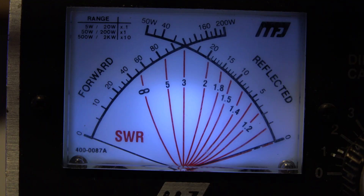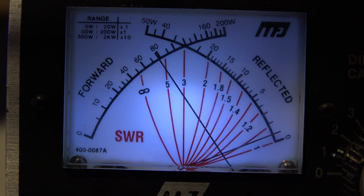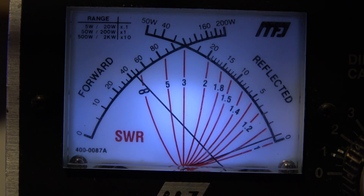Switching over to the much more precise external meter — this shows about 75 watts, maybe 80 with a lot of imagination. It's a bit shy of 80 watts, still on a CW dead key at 100% output. I'm going to regulate down just to make sure this all works. At 100% — 100-watt power output setting — dropping down to 50 watts on the radio shows 40 watts on this external scale.